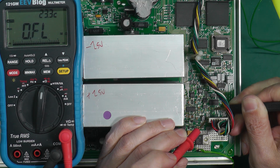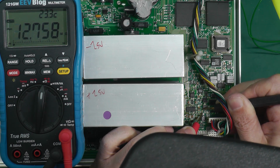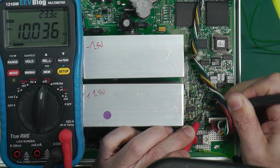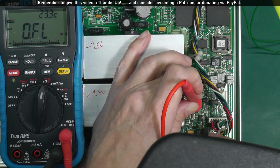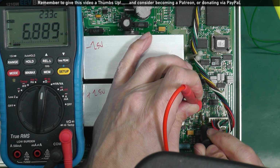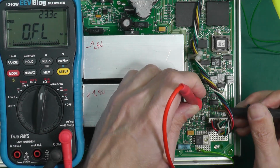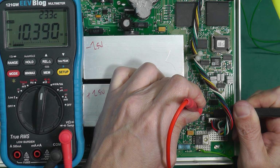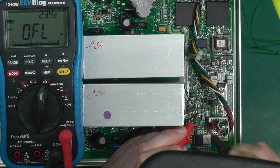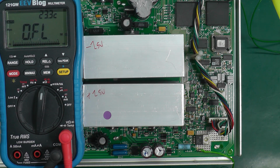And then on the other op amp, the inverting op amp, it's R8 and R9. 10k and 20k. R8. Well, that's 10k. And R9. Oh, this one's not looking good. R9. 20k this should be. 10 megaohms. Yep. I'm going to change out all 4 of those resistors.